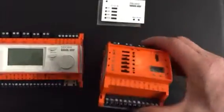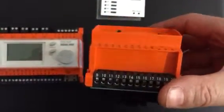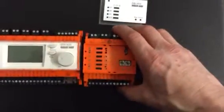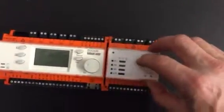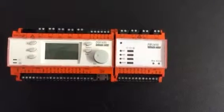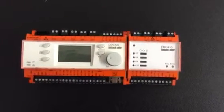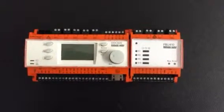In terms of the product itself, it's DIN rail mounted with removable terminal blocks, which are numbered to match the terminals on the device. It's a small form factor — we do offer panel mounting kits that would allow both components to be set side by side and visible through the control panel fascia. Alternatively, you can have the field bus modules mounted anywhere in the building or in the rear of the control cabinet to suit yourselves. Any feedback on the video is greatly appreciated, and any questions, just log on to our support forum and raise a question. Thanks very much.